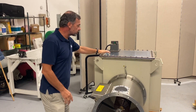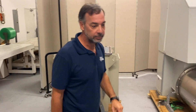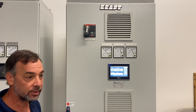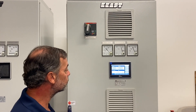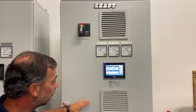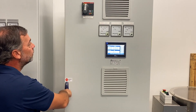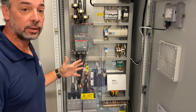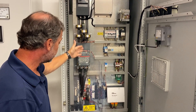With a TR set, this is sitting on the roof of your precipitator — it's out in the elements — and you have a separate control cabinet. This control cabinet is typically in an MCC room or a control room somewhere where there's an HVAC system and the environment's controlled. It will tell you the readings, and with modern controls you can do a lot of troubleshooting and graphing from this separate control cabinet. The control cabinet holds your control components, where the TR set just steps up the voltage and rectifies it to the precipitator. It has your control components: a breaker, contactor, and thyristors.